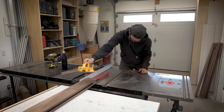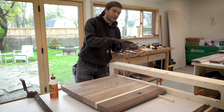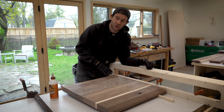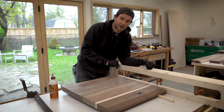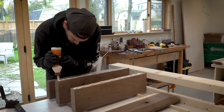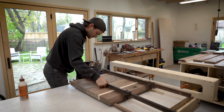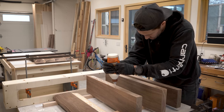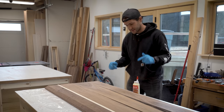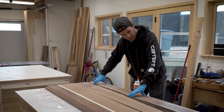Then it was time to glue everything together. I have all the wood laid out and I've clamped my router sled to the table to act as a straight edge to keep everything nicely aligned along the important side. I applied a thick bead of carpenter's glue to each piece, spread it out with my fingers, and then clamped everything together to let it dry. Once one side was done I did the other, before setting up to glue the top. This is going to be the hardest one — there are a few little complications to this one, but I'm confident I can do it.